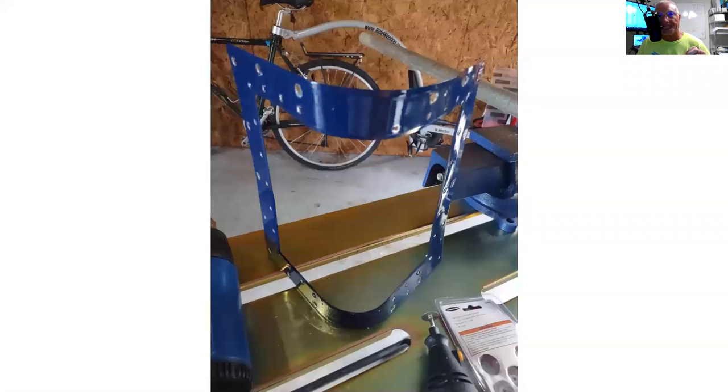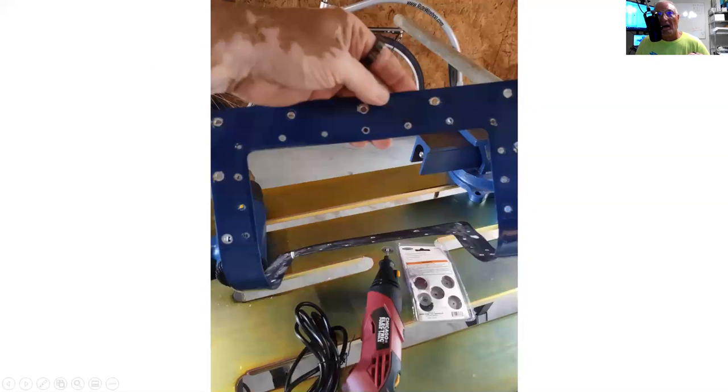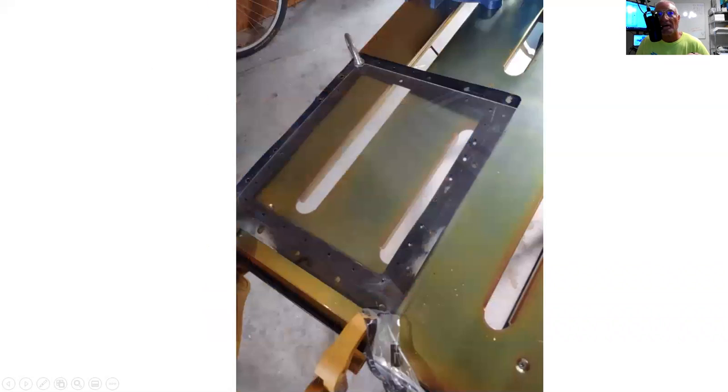to heat it. Okay, so this is the aluminum piece that the polycarbonate mounts to. You'll see there's bolt holes that holds it onto the plane, and then there's the rivet holes that holds the plastic in place. Another look at it. This was actually the top. Hopefully you can see the cursor. Once again, mounting it, trying to cut it as close as possible, yet make sure you don't cut too deep, because you've got to have enough room for those rivets to grab onto some meat.